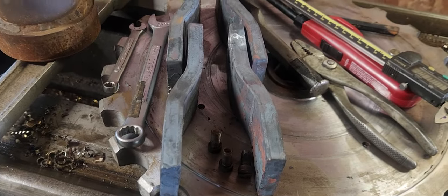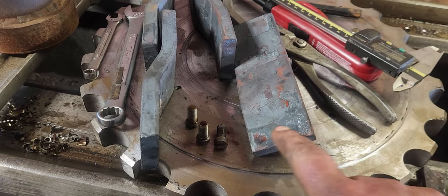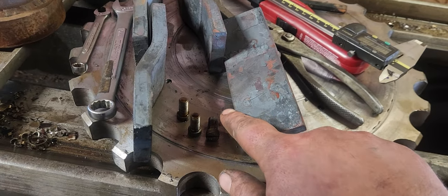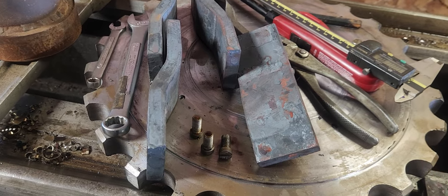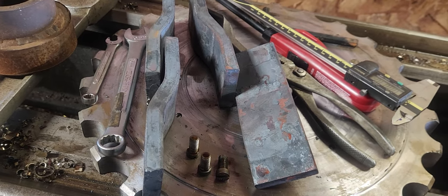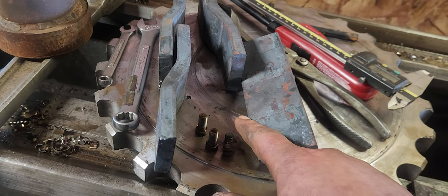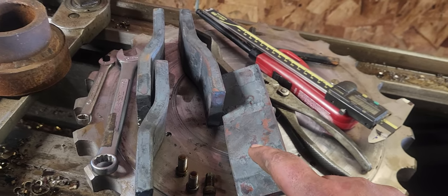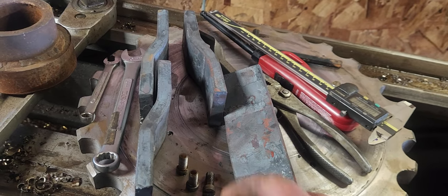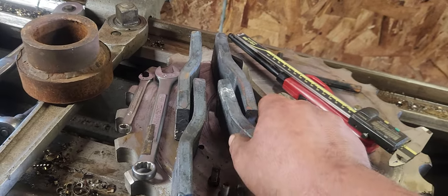I've started forging out track links. I had wanted to make dies to round these out on the punch press, since they need to be rounded to mesh properly. Then I realized that's a lot of work, so another option is my plasma cutter - make a jig, machine the two holes in the links, then use a jig to plasma cut the outside radius. That's going to be faster and probably work better since I'll be centering off the hole centers. That's a whole other can of worms I'll get into in another video.